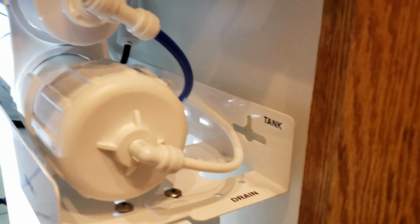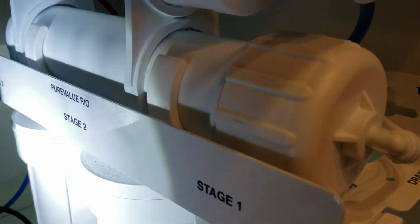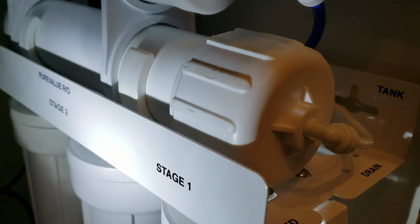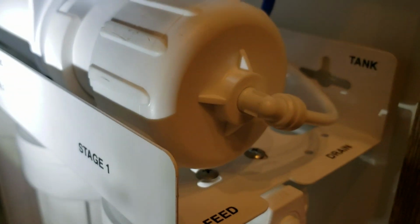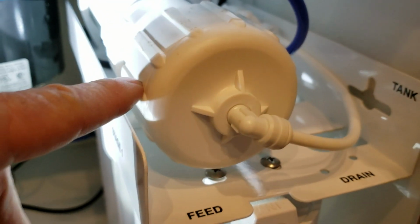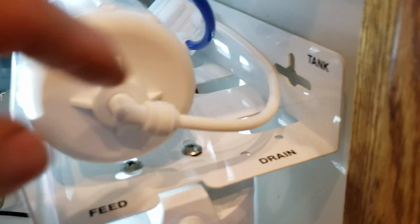What we did today is, the homeowner felt that the original installer had come in and taken something out of the unit and didn't replace it, and they are correct. So on this canister here that holds the RO membrane, we took apart 3 lines. These are all John Guest fittings. So here you depress it, pull the white line out, and in the back, we can't get down there and see, but you can see that black line loops around, and back toward the back, it ties in to another John Guest fitting, and right there you can see it.